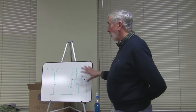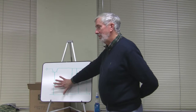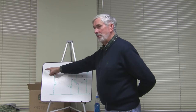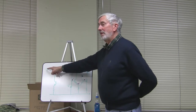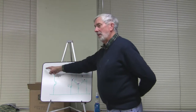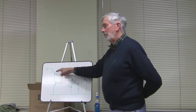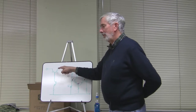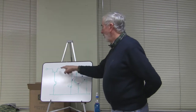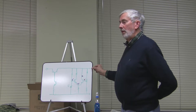This is going to wind up being a voltage regulator. The supply voltage — 23 volts in an Astron, or 33 in the case of this Johnson power supply — is going to be regulated by a series pass transistor. We're going to get out 12 volts.